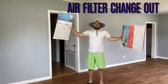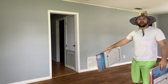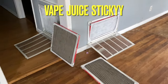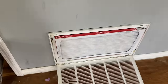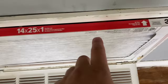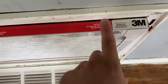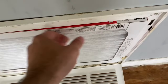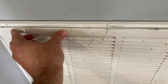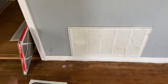I'm here to change the air filters. I've got two air filters to change — one here and one there. You can see the dirty air filters here and the clean ones there. I have a whole video on this which I'll link up there. You can see it'll say the size you need — you measure it, get the same size, make sure the airflow arrow is going the right direction, push it in and lock it up. I'm going to do that on the other one too.